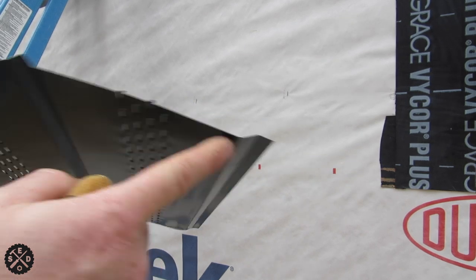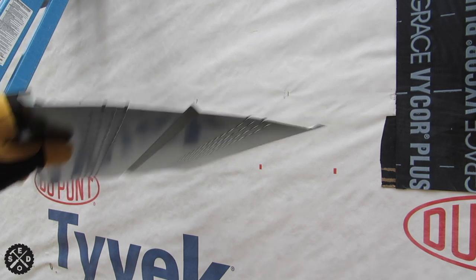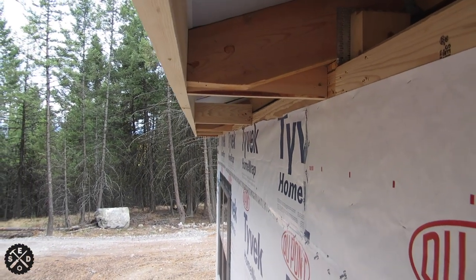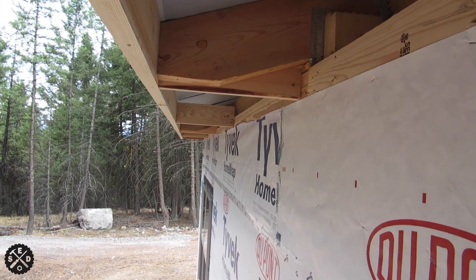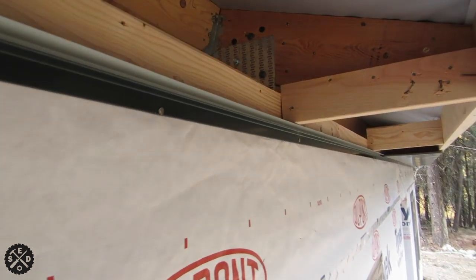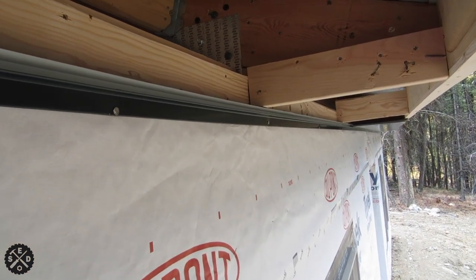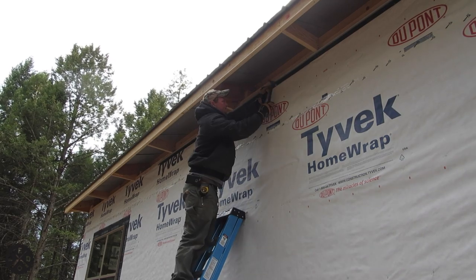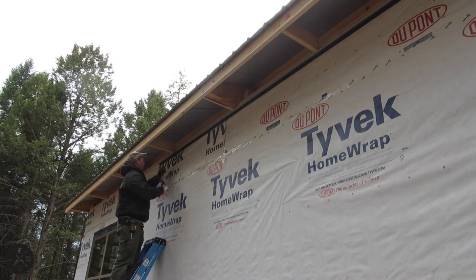This one just slides inside the other - that shows you how you slide one into the other. I had to end up putting a half-inch strip on my fascia to bring that down. I use a big rafter square, an L-square, and put it against the building with a block by the rafter tail, then put one in between as well to span the distance. Then I put my F-channel right up against that. I put the F-channel on first against the building, put all the soffit on, they lock into each other, then I put a roofing nail in where it's going to get hidden by the fascia.